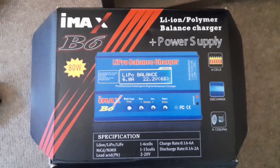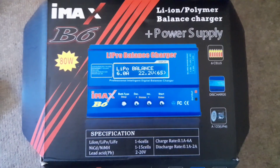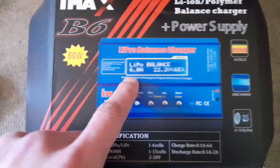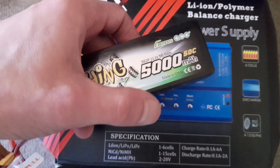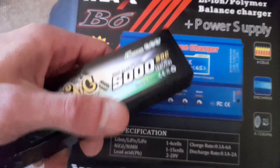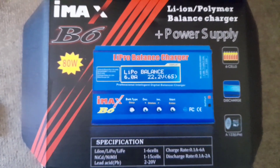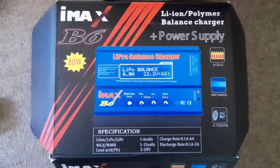If you're wanting to buy a charger and looking at the iMAX B6, just be aware there are fakes going around, although I don't know how to determine whether one's fake or not - if you know, hit us up in the comments. For charging amps: 5000mAh is 5 amps, 1100mAh would be 1.1 amps though I'd always do it at 1 amp. I always charge a little short - for 5000mAh I do 4.5 amps, for 4500mAh I do 4 amps. Anyway, like, comment, share and subscribe!